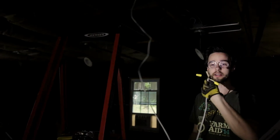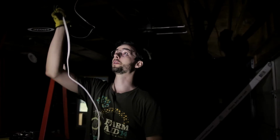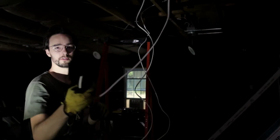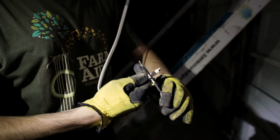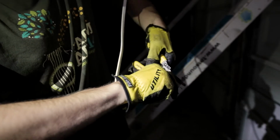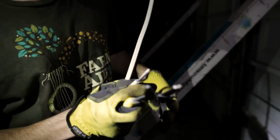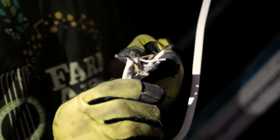We've got our switch wire here. There's gonna be a wall going right here for the bathroom, and we're gonna have our switch about right here. Now I'll show you how to fix your wire up so that you can connect it. Take the bottom end of the pliers, lightly score. You don't want to hit the actual wires inside, you just want to get this cover off. Take that cover off, bend your wires out. Now you just strip your tips off.